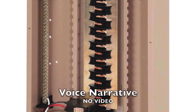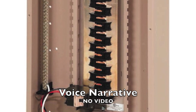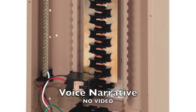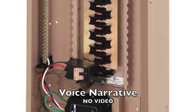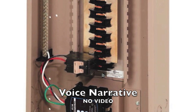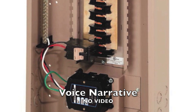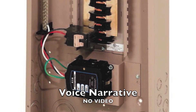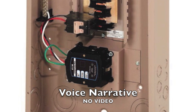The key here is that there's a much shorter distance between the main bus coming in and the surge protector — within inches on the wiring — whereas to hit your refrigerator with a surge you'd have to travel dozens to hundreds of feet up the wire. Hopefully the surge is caught at a shorter distance and dumped. That's what we're trying to accomplish here, and I didn't want to reconfigure my entire panel.